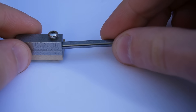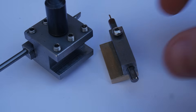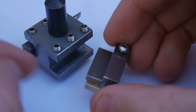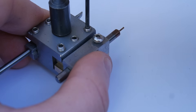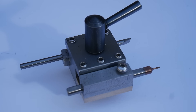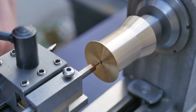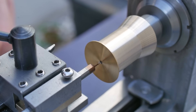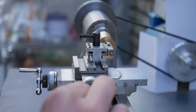We need to bore the hole using this micro boring bar. I made this simple holder so I can mount the round boring bar in my tool post accurately on centre height. I bore the hole just shy of my final target size which is 2mm. Rather than boring all the way to size, I take it to within tolerance with the reamer.